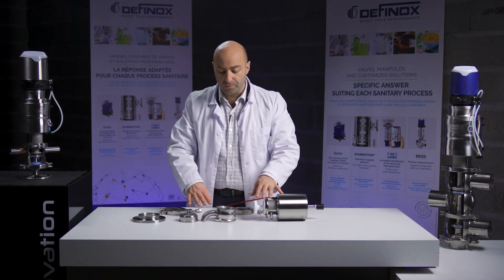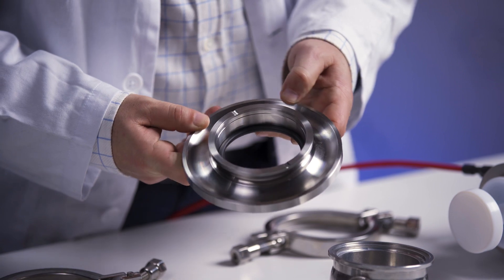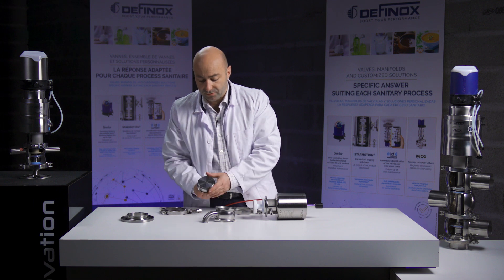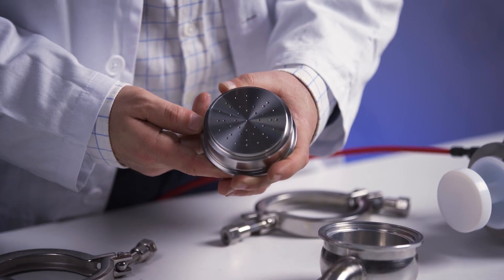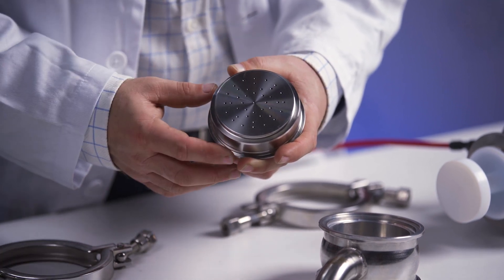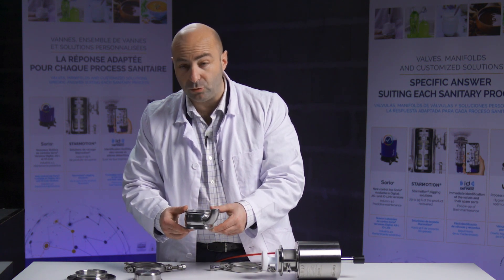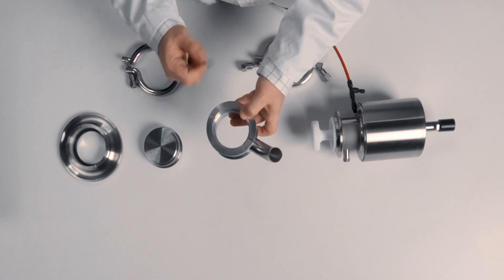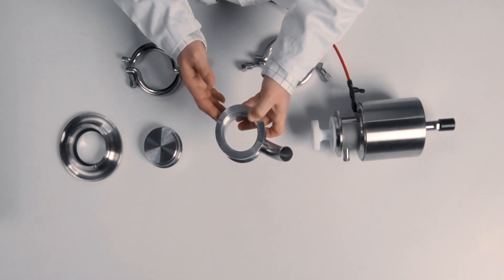The valve is composed of four components. We have the flange, which will be welded on the tank. The spraying plate with its hole pattern, which covers a maximum 70-degree angle — the quantity of holes depends on the design of the tank and the agitator we want to clean. The body — this one is an L-body DN25 — and also a T-body DN25, where a second port is placed on the side to provide a drain point or to connect several valves in series.